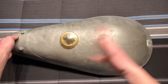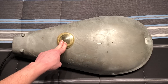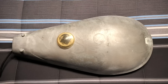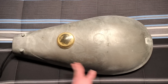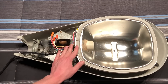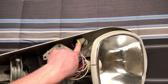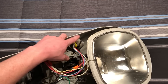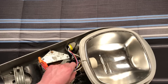Let's take a look at the back. We can see all the paint is pretty much sun-bleached away, and we do not have a photo cell — just like all of the M250As that I have. None of them have photo cells, and I think the place I got these from did not use them because everything was on a relay, so they could turn them on and off in a big group instead of individually. The fixture is in pretty good condition — all the rough stuff here is from production. We also have the igniter, which I had to replace. This one came from a 150-watt high-pressure sodium ballast, but they work in the range of 35 to 150, so not a problem.